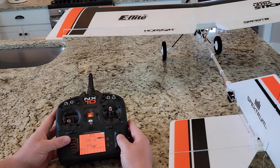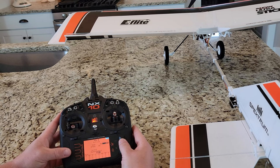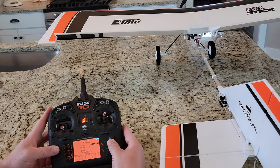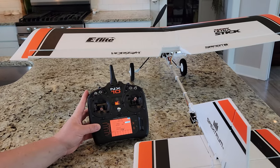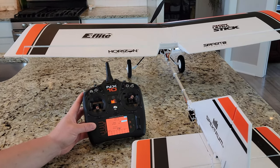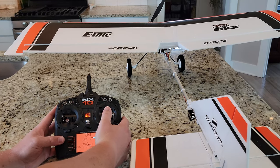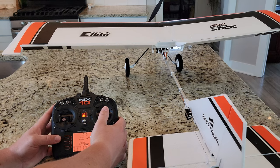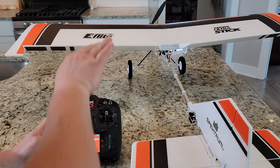Okay, so with flaps deployed, look what's happening. It's moving more. It's a multiplier now. Look, we have discovered it. There's 100, so now we're all the way up. Now we're a little bit up. Now we're neutral. But look, ailerons, spoilers, ailerons, spoilers, aileron. So that would roll us that way.